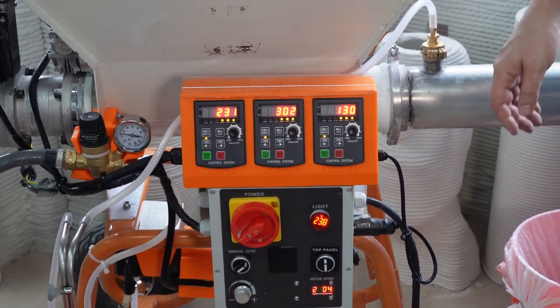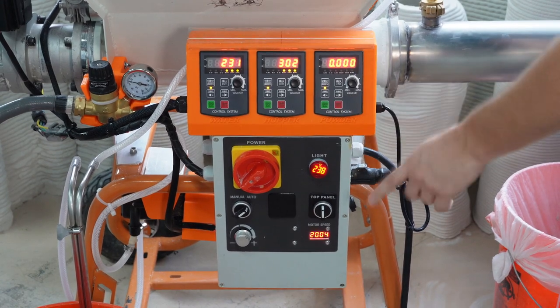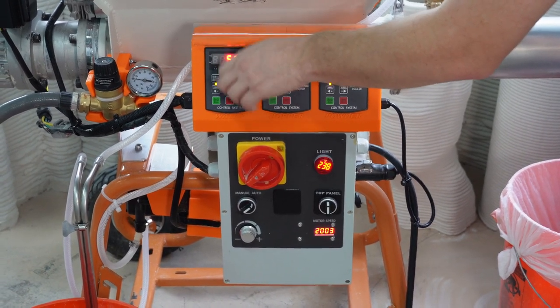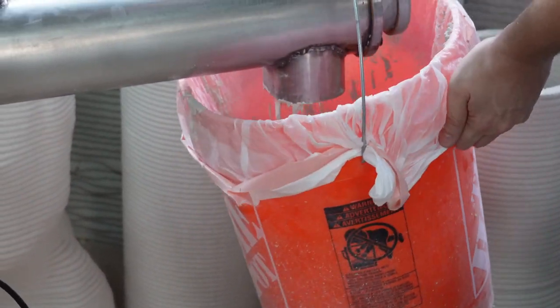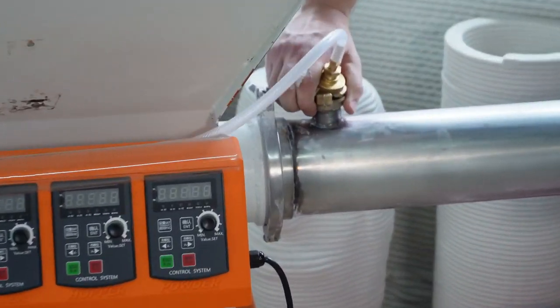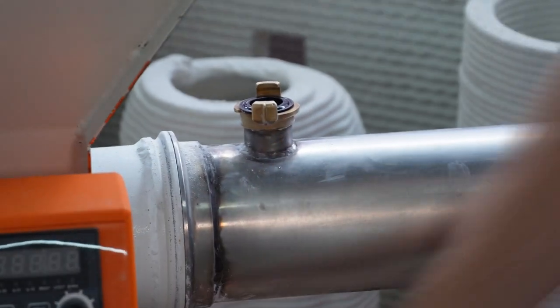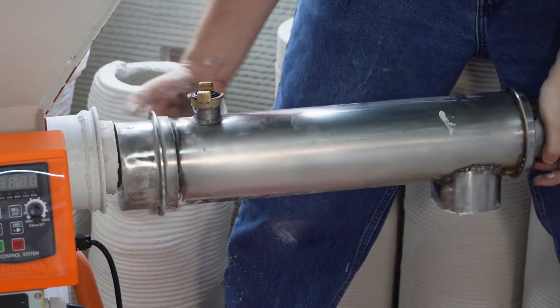Now we will go over how to clean the machine. Cleaning must be performed when you are done mixing material. To start the cleaning process, turn off the powder feed and the hopper agitator, then turn up the water speed to at least 700. Let the machine run for at least one minute, or until there is nearly no cement and only water coming out. Turn off the water and mixer. For safety, always turn off the main power switch before removing parts from the machine. Disconnect the water hose from the mixing chamber and undo the securing clamp — make sure to not lose the clamp. Pull off the mixing chamber; if there is resistance, you can use small back and forth movements to pull it off as shown here.